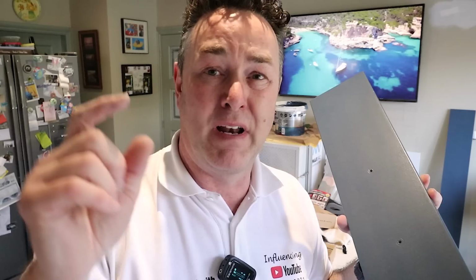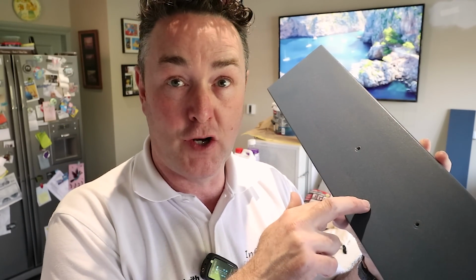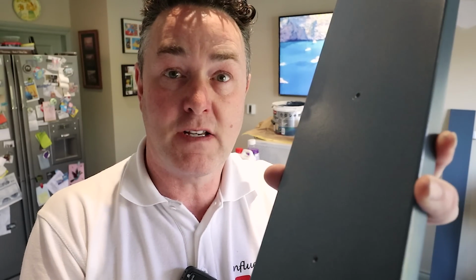Now, please comment below, what paint would you have used in water-based that gives you a 40% sheen that you knew or know would cover for 2 coats over that dark grey? Now, I would say, really, Farrow and Ball need to tint their undercoats more to the colour of what their finishes are, because if I hadn't got a grey underneath, that would be really disguised.